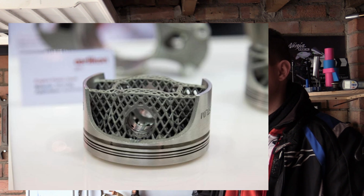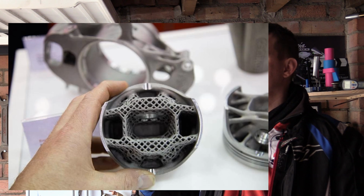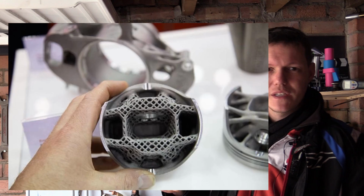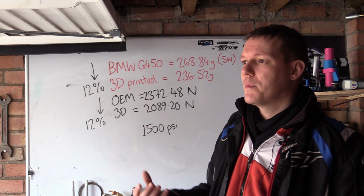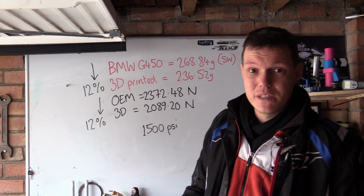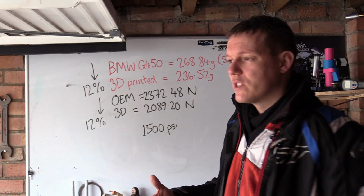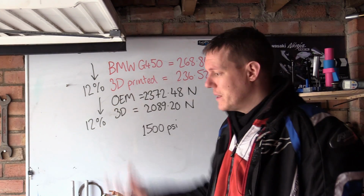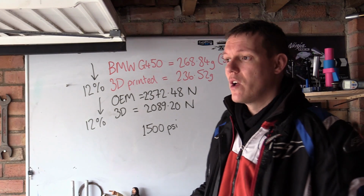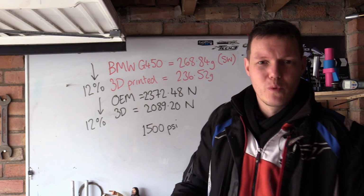The problem with that is it's kind of twofold. It allows oil to go into the matrix of the entire piston, removing heat from the piston crown. But if you have a look at the BMW piston crown, most of the piston crown is exposed for that very reason. But there is one other thing as well, is that oil will then sit in that piston, which increases its inertia when you try and shift it. It's only oil versus aluminium, so the oil wins out.